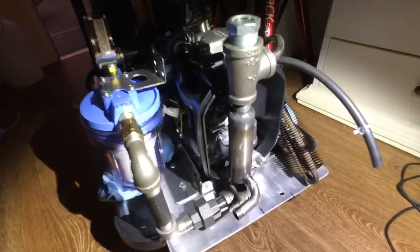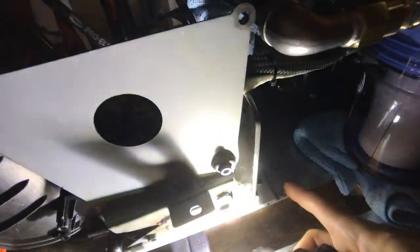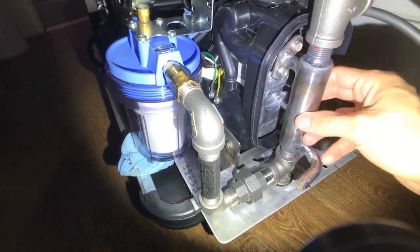Okay, there's the GEET engine. This whole platform will bolt onto the trailer. We put an electric starter on it — I'm still tightening all the piping together. This is mainly the GEET system right here. The GEET fuel system is where the exhaust and fuel come together — not to contact each other, but basically the carburetor — I'm calling it a carburetor, but it's an air-fuel mixer — it used to be connected here.